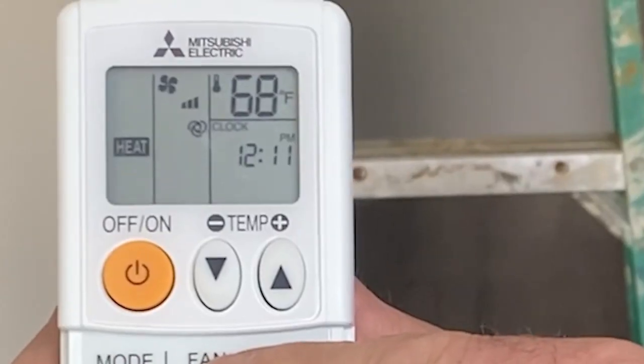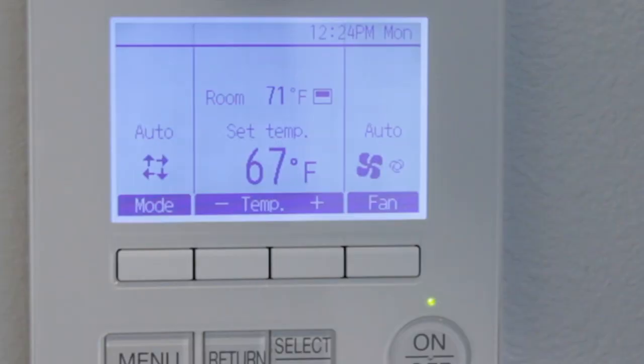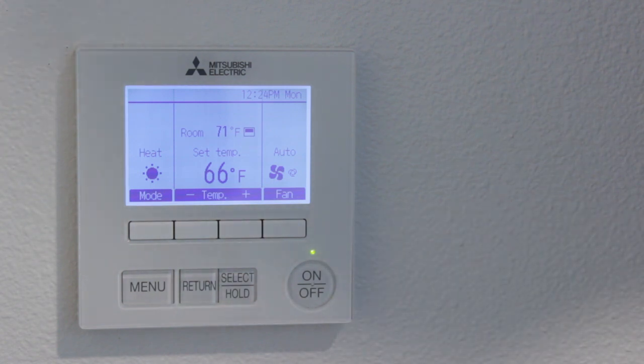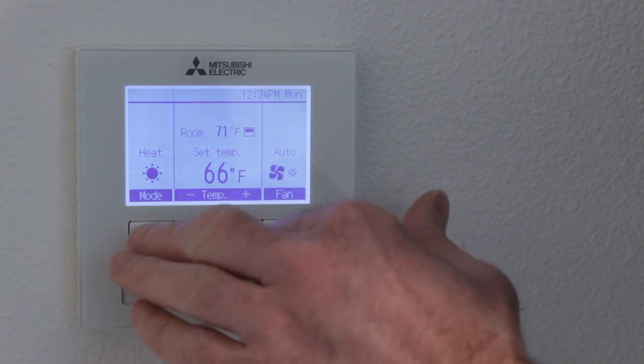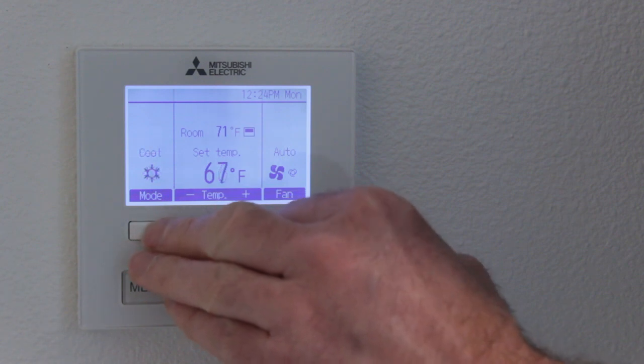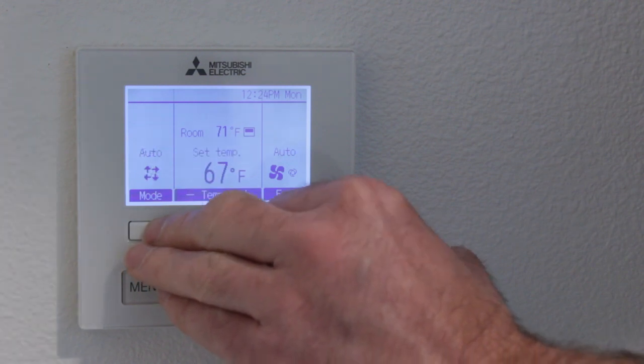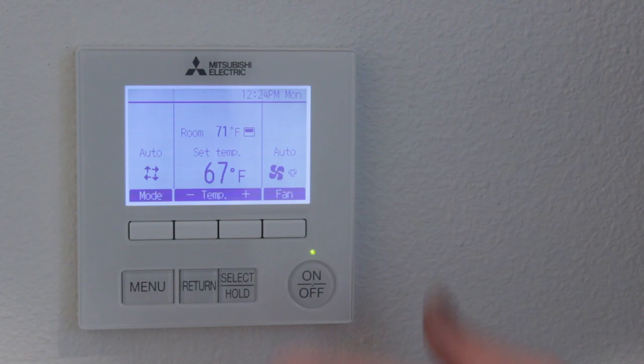So we've gone over system maintenance, gone over how to use the system, the importance of not using automatic for the system mode, but selecting either heating or cooling, the importance of set it and forget it. One thing that was asked, if you like to turn it down a couple degrees at night, that's totally okay. You can even go in and program it, although the programming is pretty clumsy on these. I'd recommend, if you like it a couple degrees cooler, just simply bumping it down at the thermostat. It's avoiding a large setback, like a 10 to 12 degree setback. That's where these systems will take way longer, use way more work to bring that temperature back, which also is a good segue into design temperatures.